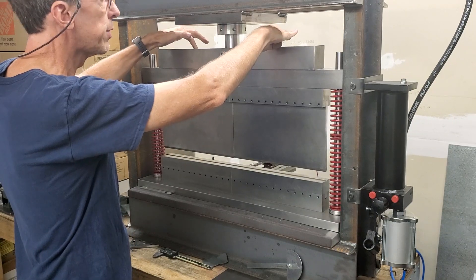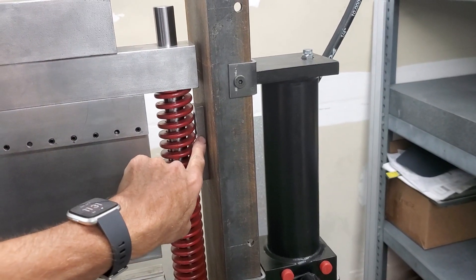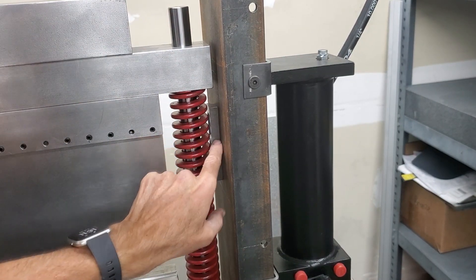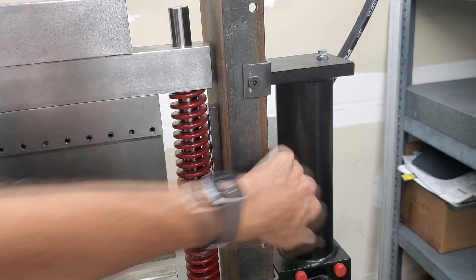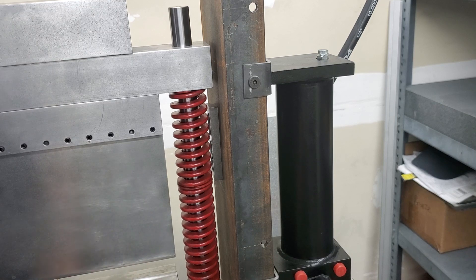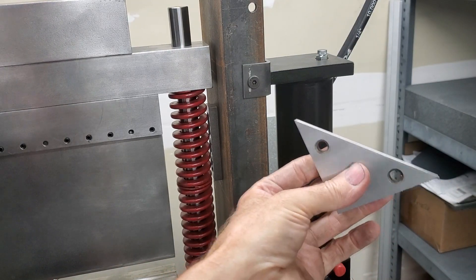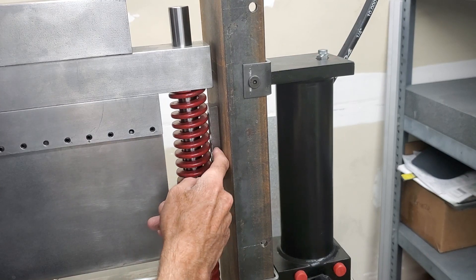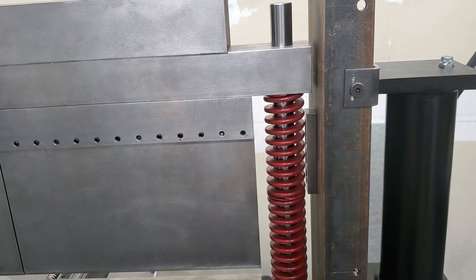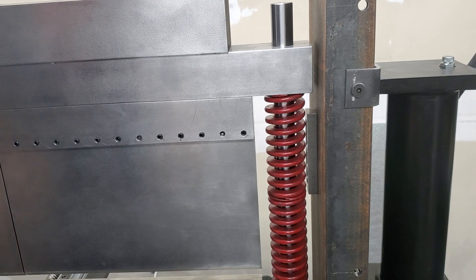I've got two half inch bolts bolting through. These are all bolted down with 3/8 bolts. I've got two angle stops, one on either side. It's basically an oval machined part — I've bolted through with carriage bolts and I can adjust the height. I just lower the die until I form a 90 degree bend. I use a 45 degree square to get a 90, verify the 90 degree bend in the material, then set these and tighten them up. That gives me my repeatable angle.